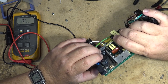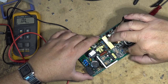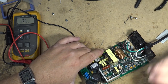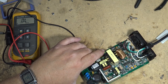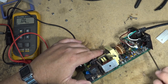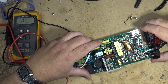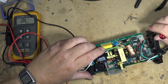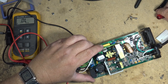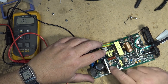This thing failed catastrophically. I don't know why — it could have been spider webs inside here. A spider was crawling around and shorted something out. You can see the webs in there. I think that's a pretty good chance of what happened, and this probably sits outside because it's for a mobility scooter. The person who owns it is actually one of my neighbors who has MS and uses this to get around. So very likely a spider crawled in here and committed suicide, taking the power supply out with it. Just hope the damage is limited to the MOSFETs.